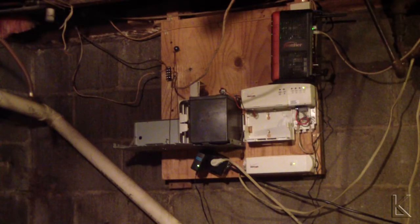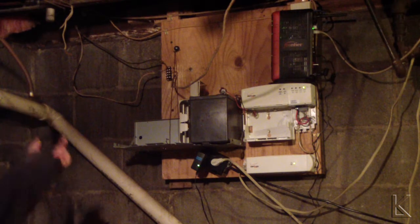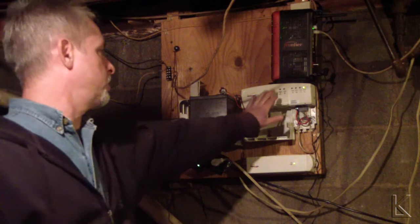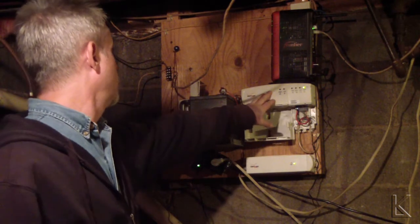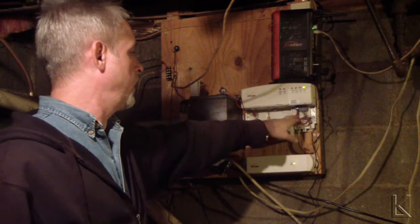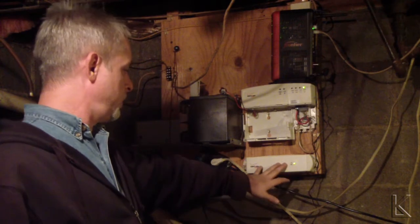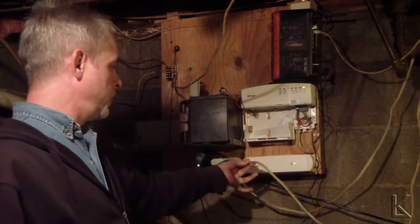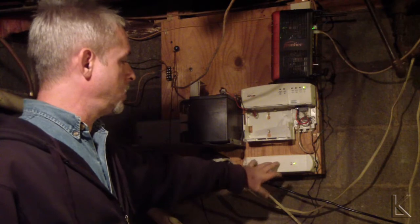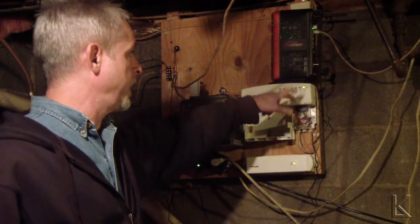This is the source of my noise. This is where the internet comes into my house — I have fiber — where there's a terminal box on the outside of the house, and this is the power supply for the terminal box. This wiring comes in from the terminal, and this is the DC power. This is their AC power supply, which is grounded with a three-prong plug, but apparently they don't ground it through the common wire out to the terminal.